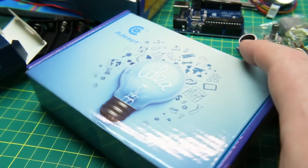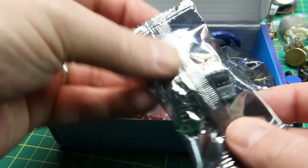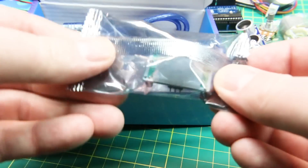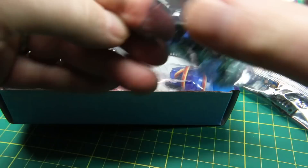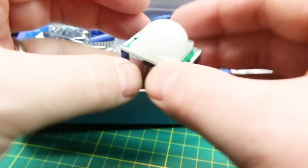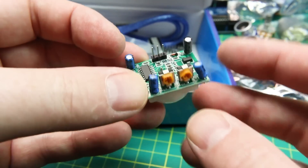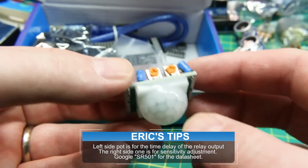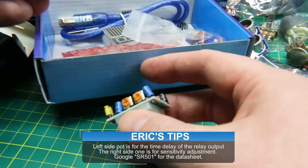There's still a whole other box. We've got a stepper driver for driving the stepper motor. There's also a passive infrared sensor — these are fantastic little PIR sensors. I used this very sensor in a home security system IoT project hooked to an ESP8266 — very easy to work with, well and truly proven. The two potentiometers on it — one is for distance and one for sensitivity.